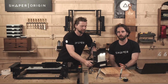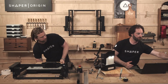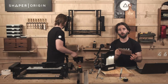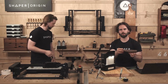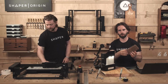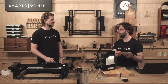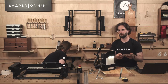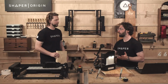Our second demo is going to be these tenons. I've got the part over here hanging out. We've shown this one off a couple of times. This is a side block from a wall hanging mirror that we're working on with Phil Morley. And it's got some really involved tenons on the top and bottom there. It also has this really interesting curved profile to it here. So fun to do. We outlined that on Origin, then trimmed it as close as we could to the line on the bandsaw, and then Jake went ahead and cleaned up and faired that curve with just hand tools.